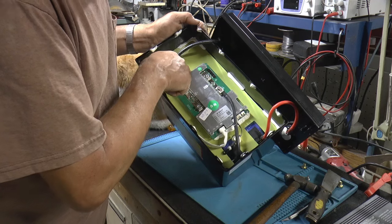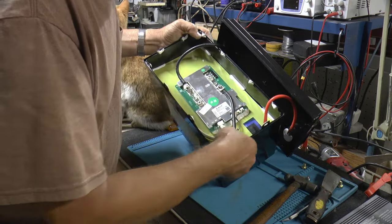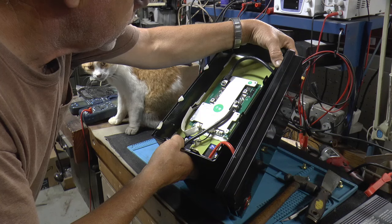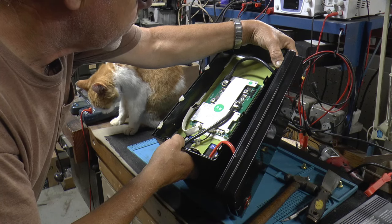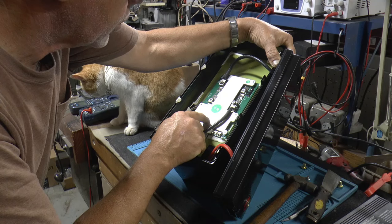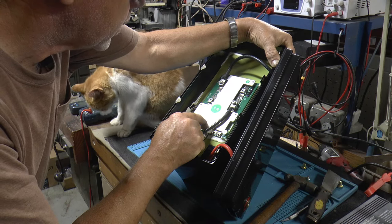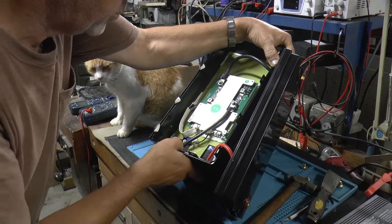The BMS looks like it's just held on this fiber board with goop. And it says on there, most of it's in Chinese, DP04S007-S version 1.7. Then there's a 4, and then there's a 100A, 100 amp. UART, and then there's a 16930036. And there's a MAC address, so that must be for the Bluetooth part.